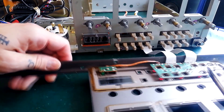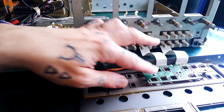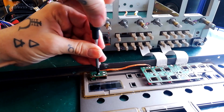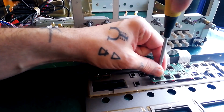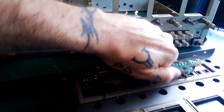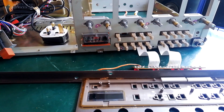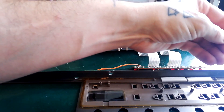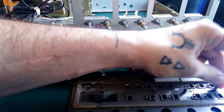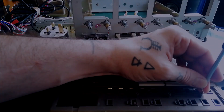I'm a little worried about the weight of this front plate putting strain on the ribbon connectors, so I'm going to detach these little daughter boards from the front case using the smaller of the two screw types. Rather than using a component box, a sensible approach is to put these screws back into their plastic mounting posts — less likely to lose them or get them confused with other screws, since there are a lot of different kinds in this build.